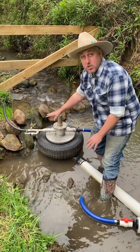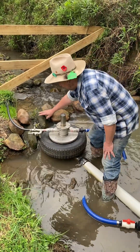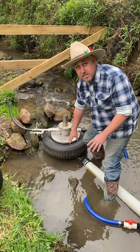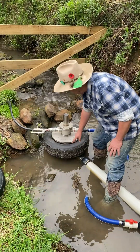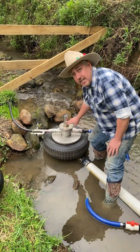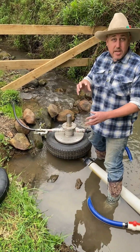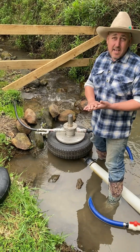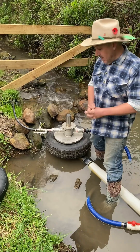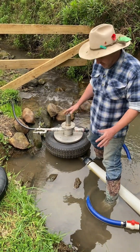These valves here are off, which is what caused it to stall. They're easy to maintain. The only real wear and tear on these pumps — lots of people reckon it's the tyre and such — but those will last forever. There are a couple of piston seals in here and it's about a 5–10 minute job to undo this, pull out the piston, change those seals — that's about it, that's the wear and tear. They can last anywhere from 6 months up to a couple of years, according to Brett from Bunyip Pumps. So far so good, just pumping away.